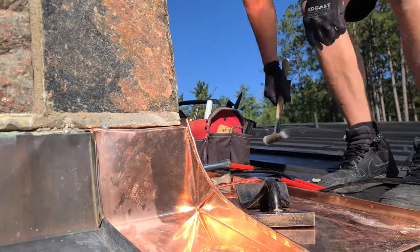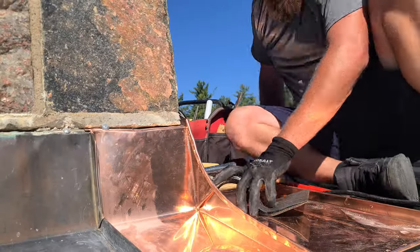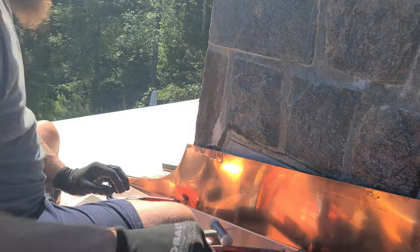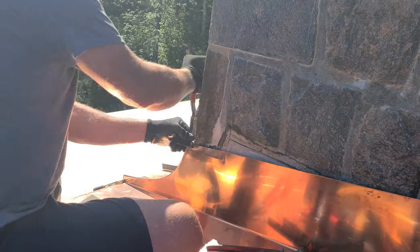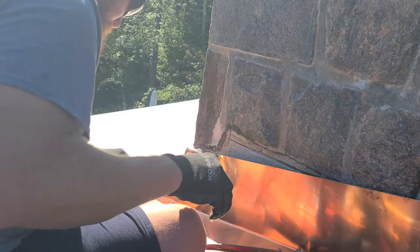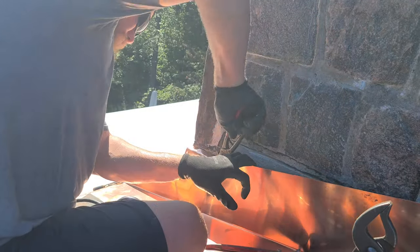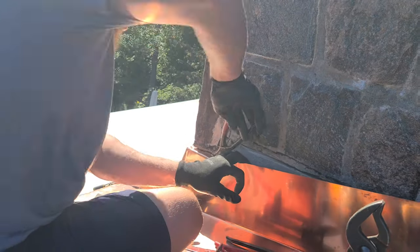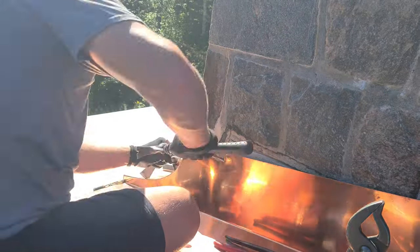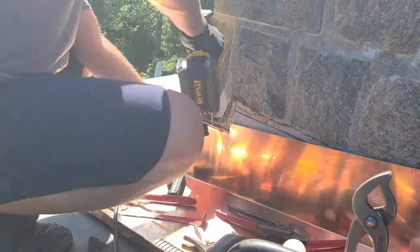I also feel good about it because these details make a lot of sense. We're turning the panel itself up the wall — we're not ending the panel at the termination and trimming things out and then caulking z-bar and so on. We're actually returning the roof panel up the side of these penetrations, so there's really no way for water to get in anywhere. On screen I have put a link — unfortunately we've come to the end of this series. I appreciate everyone chiming in. On screen I'll put a link to the playlist where you can go back and watch right from the beginning. Thanks for watching, everyone, and I really appreciate everyone's support.